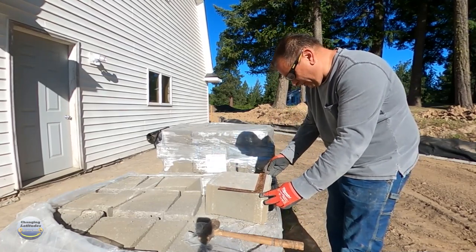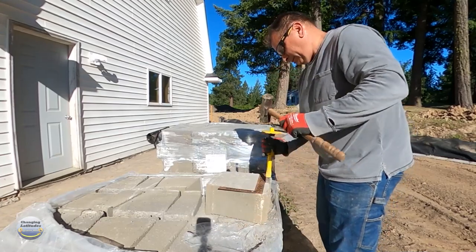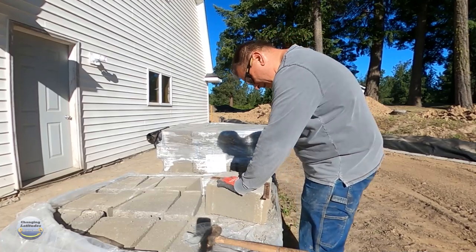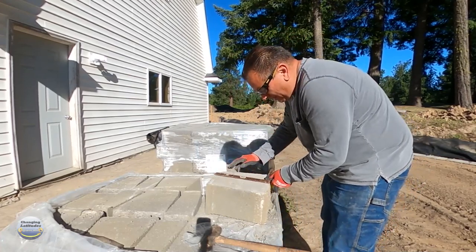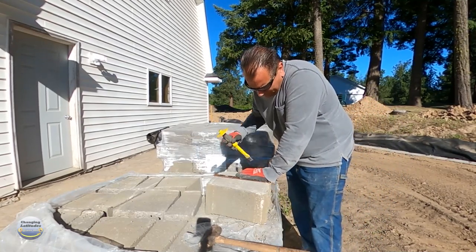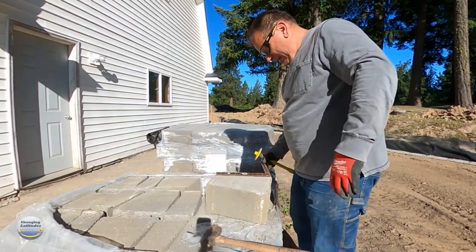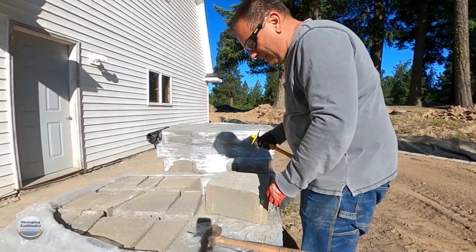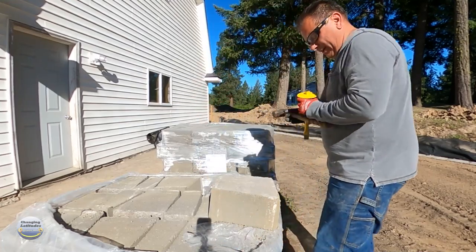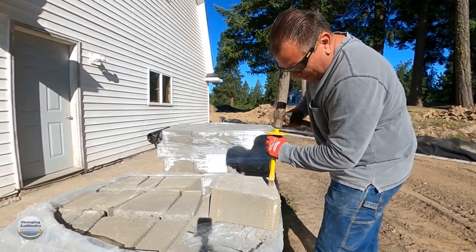One of the things you have to do when building a retaining wall with open ends is cut a brick in half. Obviously, if you just used a saw cut, it would look unappealing. So the thing you're supposed to do, I guess, is cut it in half using a chisel or a brick breaker, which I didn't have, and bust it up and it would break naturally, and it did. After a couple strokes, or should I say a couple hundred strokes, you finally get it broken and it looks really nice. As I worked with it further, I got better and ultimately produced a better result in a shorter period of time.